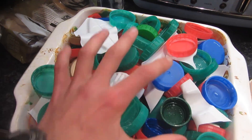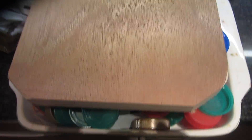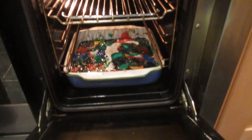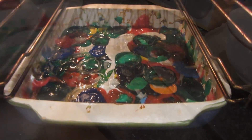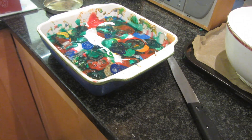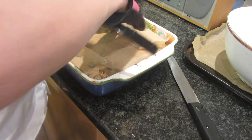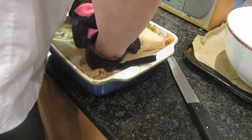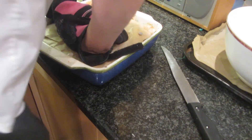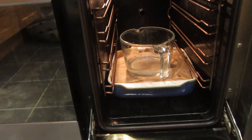Now I'm going to have a go at doing another sheet, and to make sure the top tries to stay flat I've made a sheet of plywood that can sit over the top. Everything is melted down exactly the same as last time with similar colors. Once it's been left in the oven hot enough for most of the air bubbles to come out, I take the sheet of plywood — wrapped in non-stick baking paper, since HDPE likes to stick into porous materials like wood — and put it over the top, with a jug on top to help weigh it down.